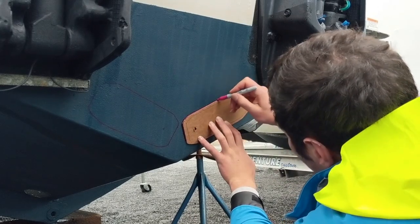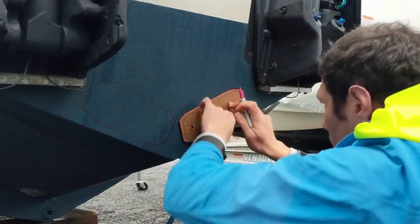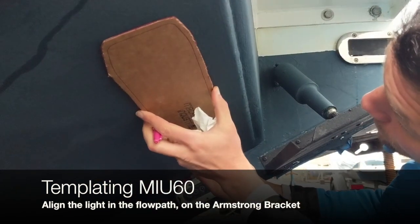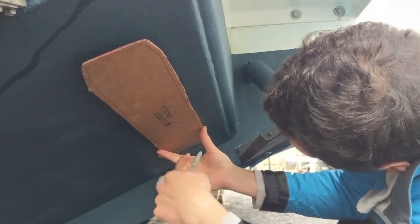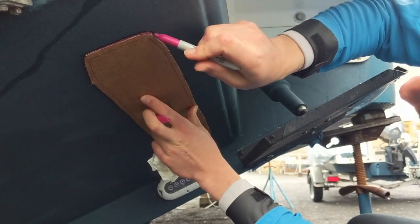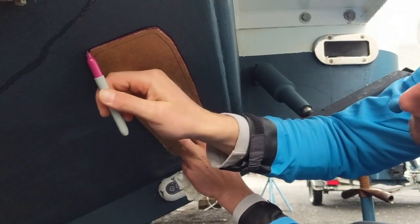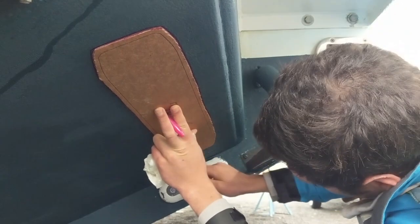I'm tracing out the template. You want to make sure there's nothing behind where you're mounting the lights — no fuel tanks, wires, or stringers. Make sure where the hole goes through you have a nice clean open area. We're doing all the lights on the Armstrong bracket of this Regulator. For running surface mounting, we prefer to put the wire gland at the forward side of the light, always longitudinal with the boat.